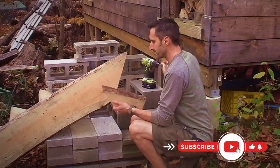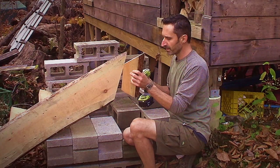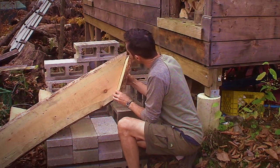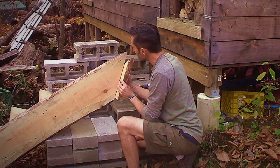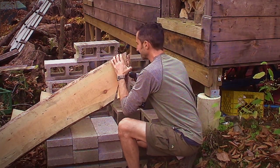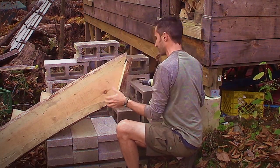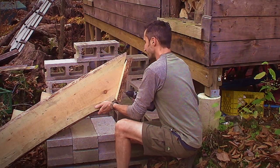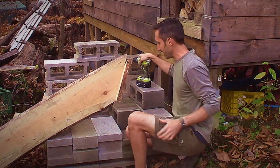Nice. Okay. So put the pad in here. For lining it up, it's nice to just poke the screws through a little bit and then back them out. Okay, poke through, back it out. Poke through, back it out. All right, and then we can line up those with this. And again, I'm making sure it's going into this section of good wood, not this crappy stuff. Okay, let's do it. That felt really secure. That's a nice feeling. It's like going from good wood into good wood, and I can feel that was nice and strong.